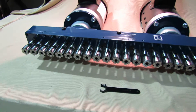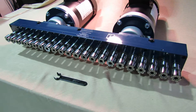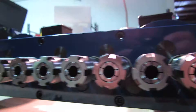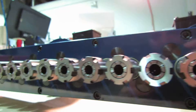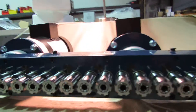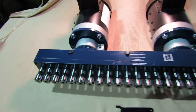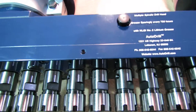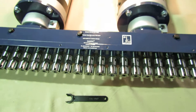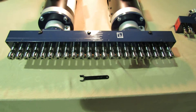We want to do a quick profile here of this head that we're looking at. It is a 22-spindle ER20 style head. The capability of this head is up to a half-inch hole. It's currently set up for three-eighths inch holes, and this customer is driving this head as it's mounted with these tapped holes along the face of the head into their product with their own custom-made slide.